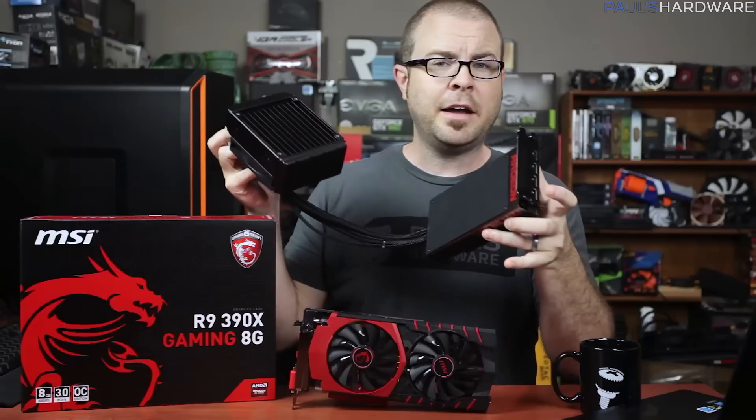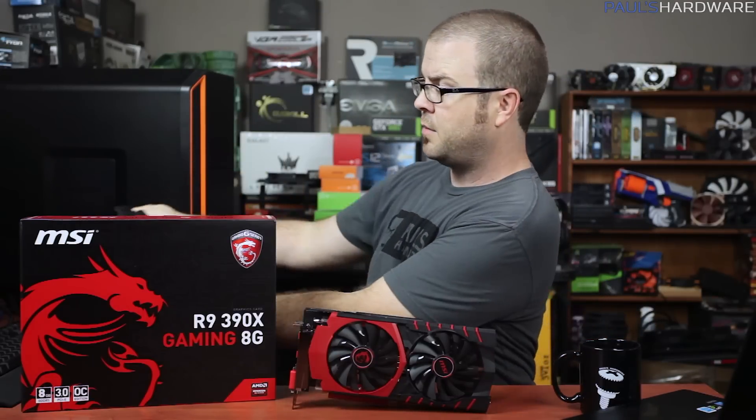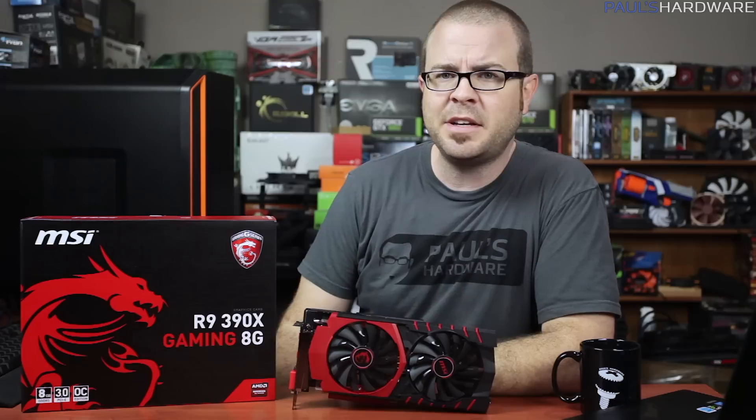Because let's be honest, it's not really a new GPU — it's a slightly more refined 290X. I do actually have a couple AMD Fury X cards, which are new, but you'll have to subscribe to see my upcoming video on that. The R9 390X uses a Hawaii GPU based on 28nm GCN architecture, and aside from AMD changing the codename from Hawaii to Grenada, eking out a little bit more clock speed on the GPU and the GDDR5, and doubling the standard memory allocation from 4GB all the way up to 8GB, there's not a ton of difference between the 290X and the 390X.